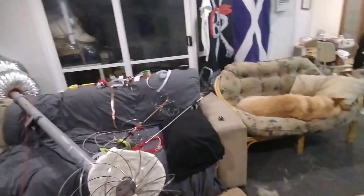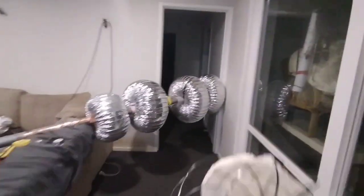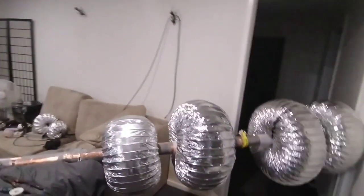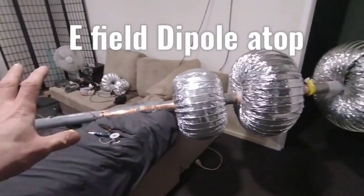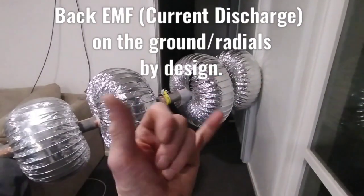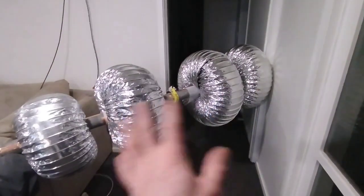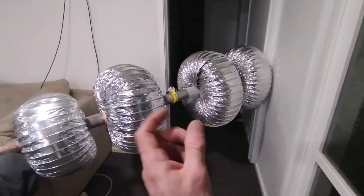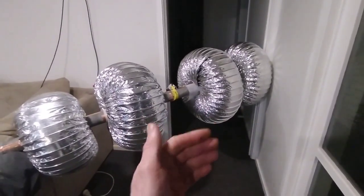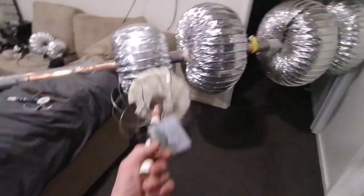Bear with me — I'm going to run around the other side. The top and the bottom are in the E-field differential to each other. It's kind of like a three-part antenna: there's the heavy current on the ground side, and this part is ringing on the high-tension side. This is not like a complete antenna, but these are always inverse in the electric field — so these ring against each other and feed back on each other in the electric field.